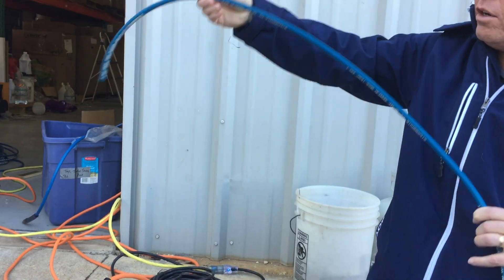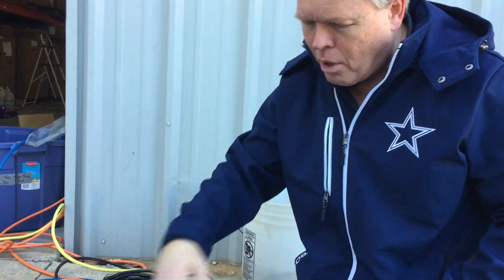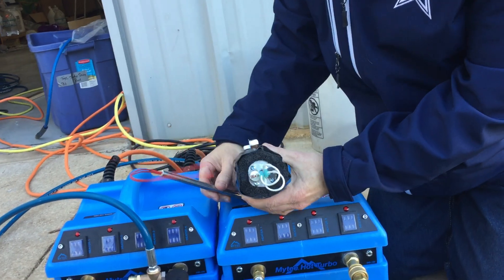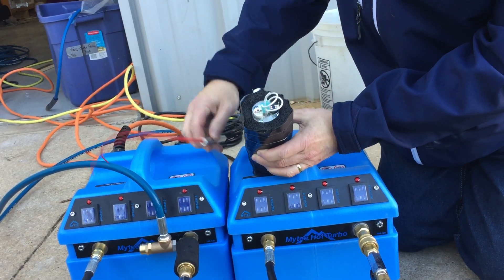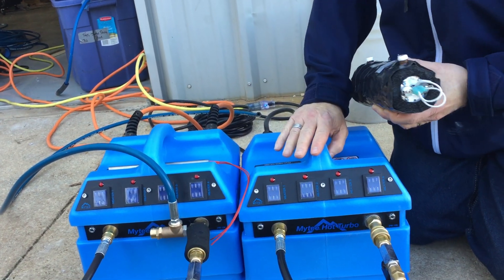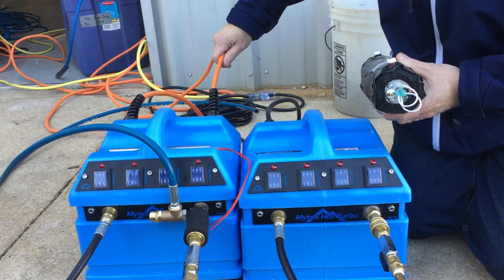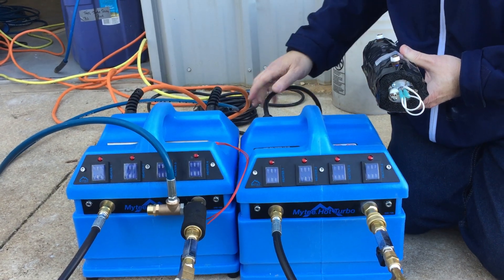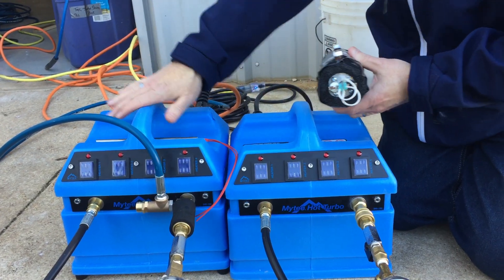This is so that you could lay this hose back in your garbage disposal, kitchen sink, or in the fresh water tank if you're portable. Normally, you would feed both of these heaters with the hot water coming out of your carpet cleaning machine. We took the 600-watt heating rods out of this style and replaced them with 875s — that's how we were able to get the additional wattage — and we added an additional power cord. This one runs 2,400 watts on one cord; this one runs basically 3,500 watts but on two cords, running 15 amps per cord, where this takes a dedicated 20-amp circuit. So this one is more likely to trip breakers in 14-gauge wire building environments, while this one will plug in absolutely everywhere.